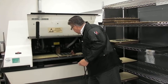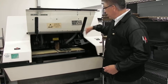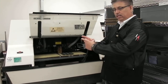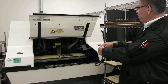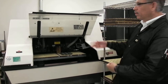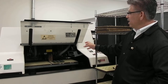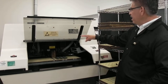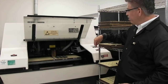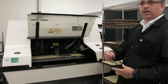The fixture holds the board and the router routes out the individual arrays. By routing, we have a vacuum and air ionizers. The air ionizers basically protect the board from ESD. The vacuum hoses, as the router is routing, suck up all the sawdust or debris fog.